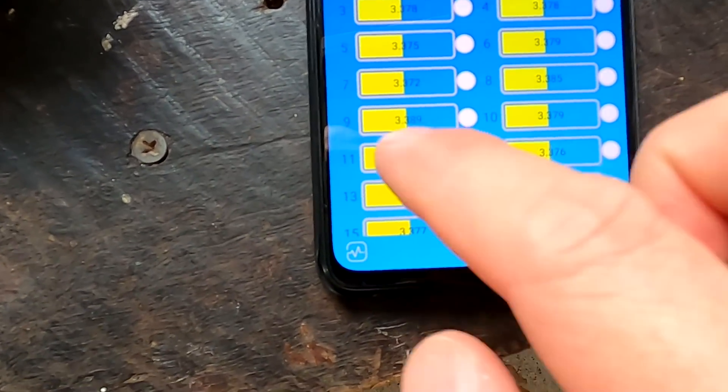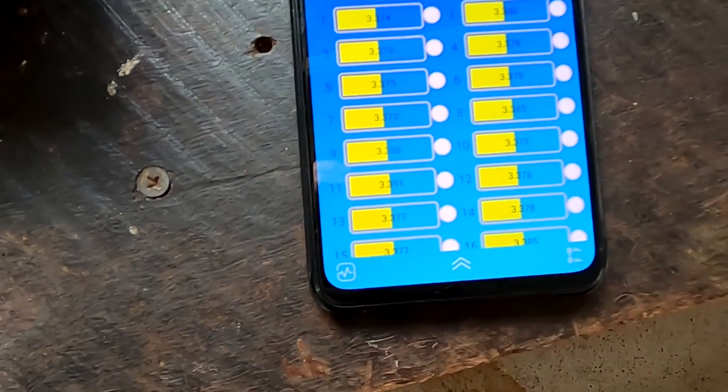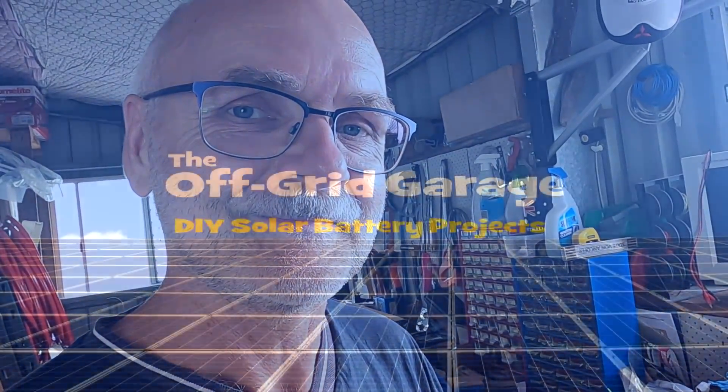Apparently so far all the contacts I've treated with this grease, I haven't had any problems. Charging at 17 amps and cell number nine is now in line with all the others — still a bit high, so there's definitely some oxidation between terminal and bus bar. By loosening it and moving the cell a bit you're rubbing the contact surfaces and removing that oxidation, and then everything is good for a while. Leave your recommendations below and share your experience — do you put anything between the bus bars and terminals, or connect directly? Thanks so much for watching, stay charged, stay safe, see you next time!